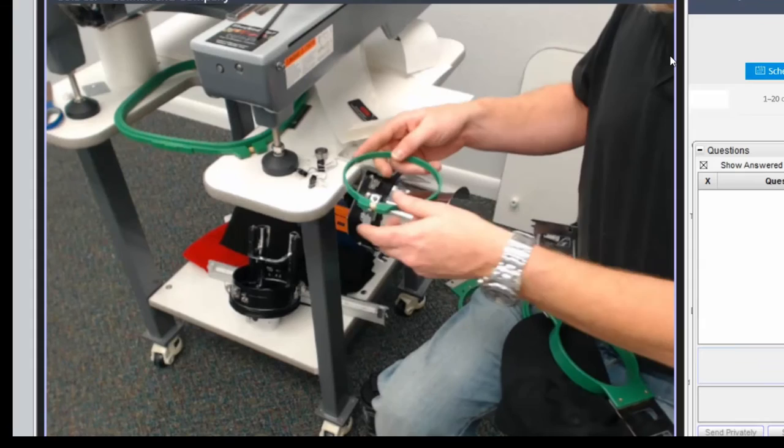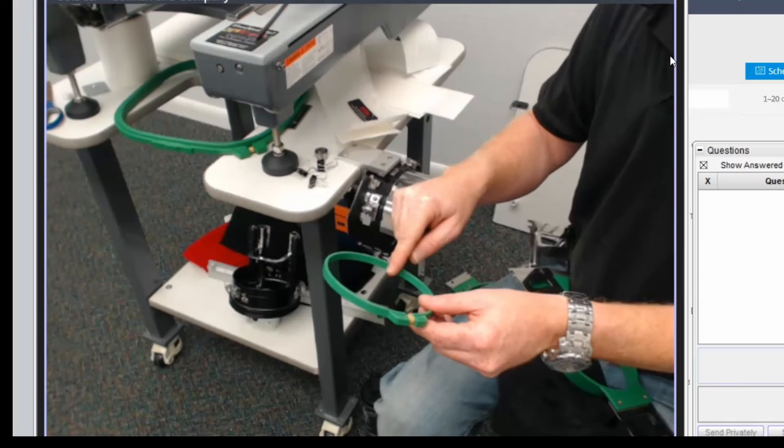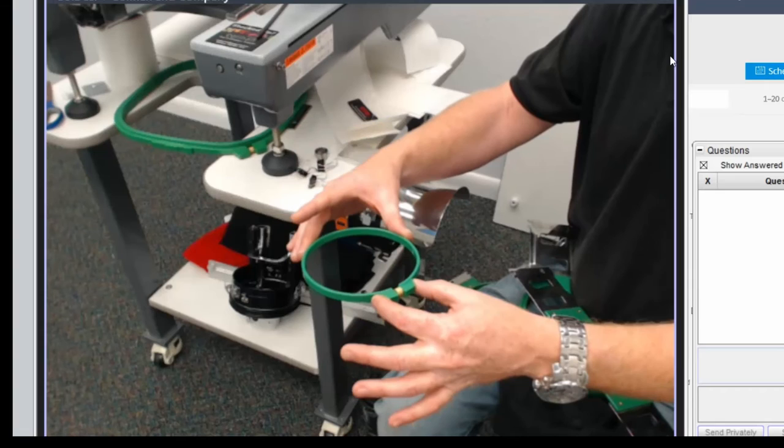I will place my hoop and draw a circle around the outside edge of it. And then I will use a router to cut the inside here. So I cut this entire shape out of that piece of wood, so that my frame can sit down in there and it holds it for me. It would be sitting on the table like this, holding it.